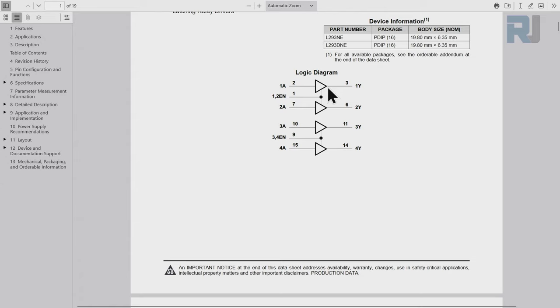So whichever direction you want, just change the values - one side must be zero and the other side should be the desired PWM value, and the direction of rotation will change.